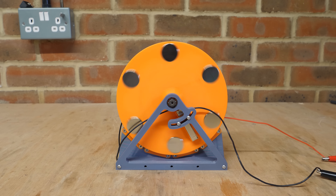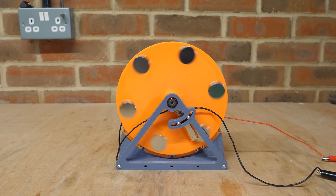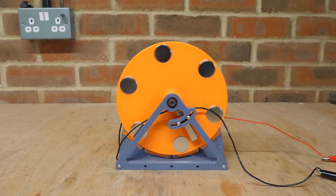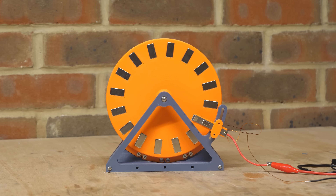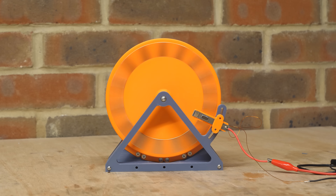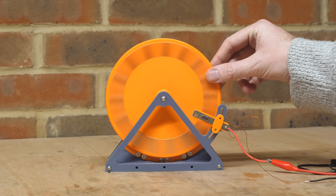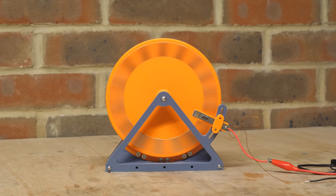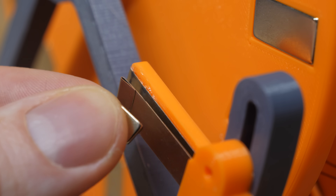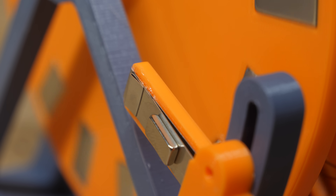This motor has very little power, mostly because it only has six magnets per rotor, meaning the coils can only push the wheel six times per rotation. If we increase the number of magnets, we should be able to increase the output power. So I built a motor with 16 magnets and alternating magnetic pole directions, and it has far more torque. The reed switch had to be modified as the alternating magnets mess with the timing, so I positioned a small magnet on the flexible strip so it's only attracted to the magnets with their opposite pole facing outwards.